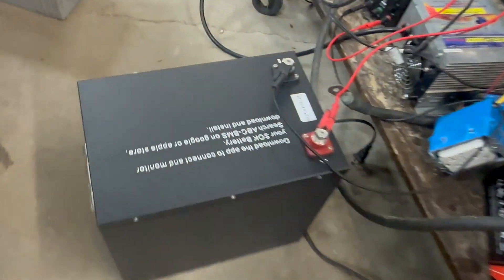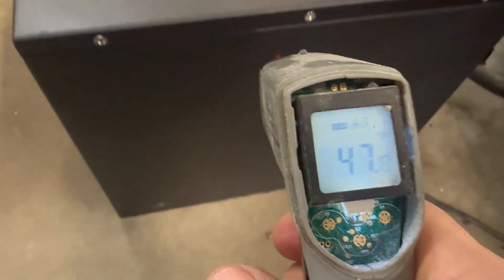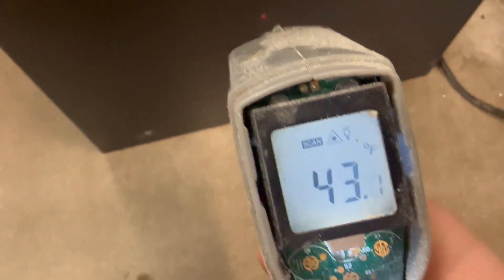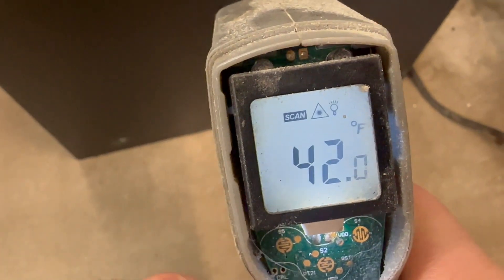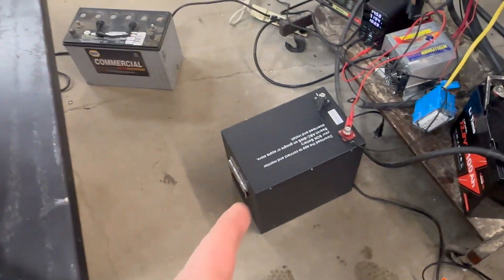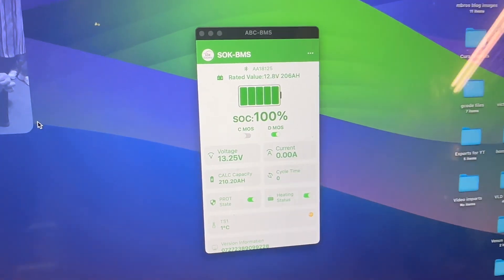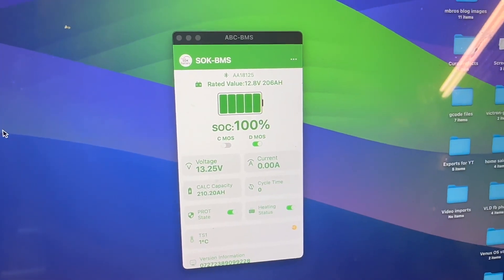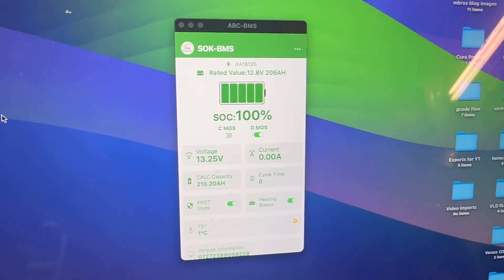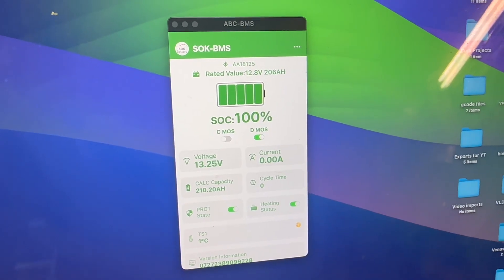If we're curious what the temperature of the case itself is — it is definitely coming up now. The case of this battery is at 47°F, but down below it's still 41°F, which is probably imparting a little heat. But internally, the battery cells are going to take a long time to actually warm up, so I don't feel like the ambient temperature in here is playing a large role.